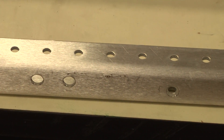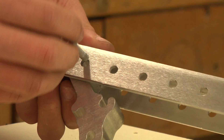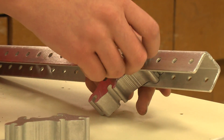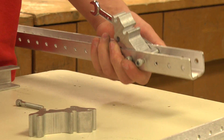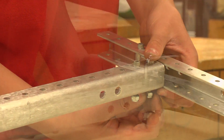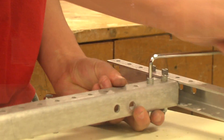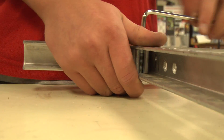While assembling the rails, ensure that the center drop holes are downwards. Now, attach the corner connector to the 4th and 5th holes in the cut C-channel rails using the ¼-20 bolts and nuts. Be sure to have the connectors positioned as shown. Then, attach the full-length C-channel rails to the connectors at their ends with the channel's flanges facing outwards.